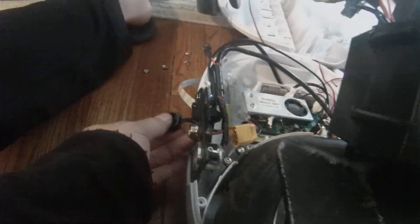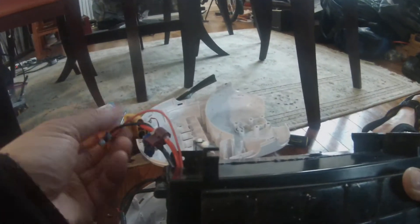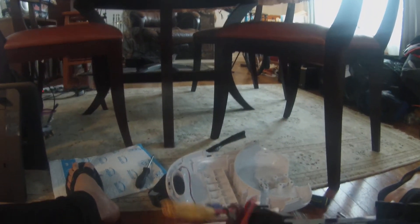So what does the battery have on it? The USB port and this charge port. Okay, so this connector here — the two-pin connector that was removed — is for the charge port. So if I'm using external batteries, I'm not going to be using the charge port, so I don't really care about that.